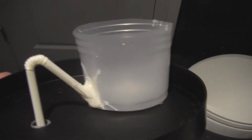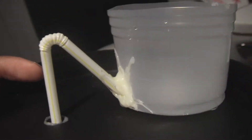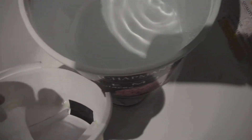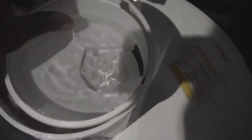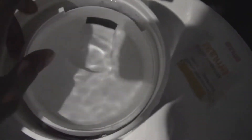I was wrong on my conclusion from before. This trap way is quite small, and when I pour water in it, it still goes down when the straw trap way fills up fully. What I just realized is that the entrance to the trap way is smaller than certain areas somewhere within the trap way — a larger pathway for water than the entrance. Because of that, it doesn't push all the air out. If I submerge this in water completely, you get a lot of bubbles. If I tilt it more, you get a lot of bubbles. When I pull it out, it's going to go down once all the air is completely out.